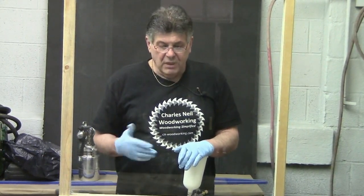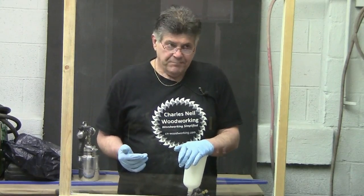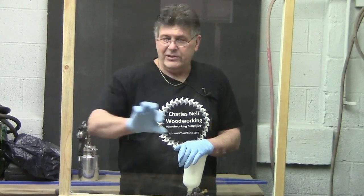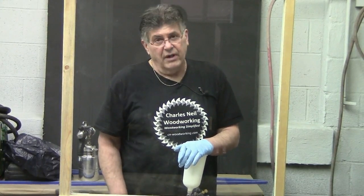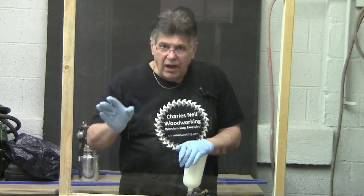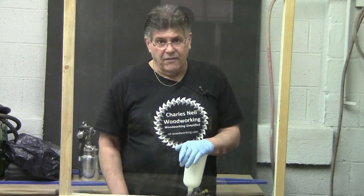Let's think about texture and compare it to sandpaper. If you're spraying and you're getting a 36 grit texture or even an 80 grit texture, you're a little too rough. If on the other hand you spray it and you're getting what would be like a 120 grit or a 180 grit, it's going to lay out for you.